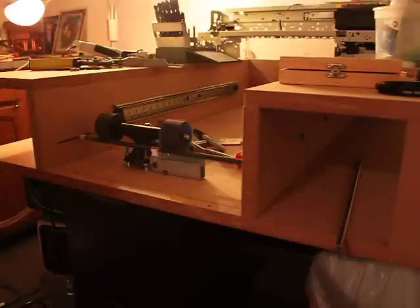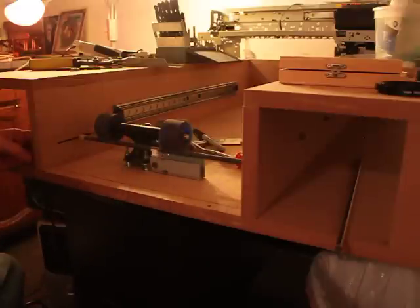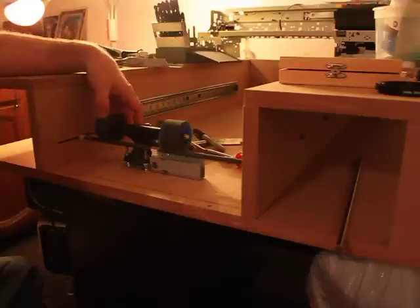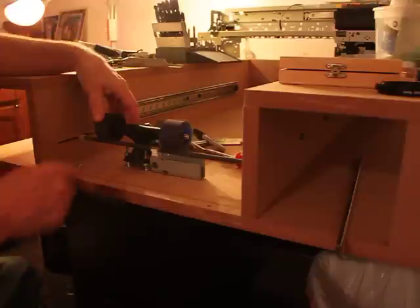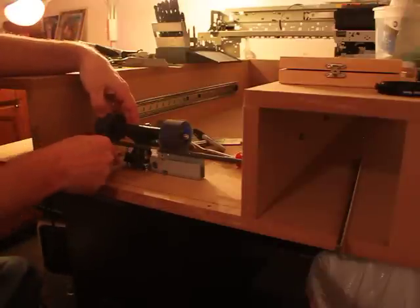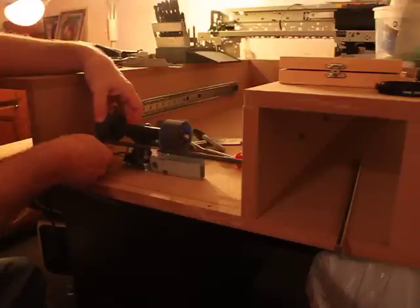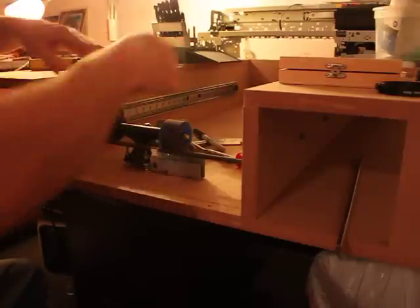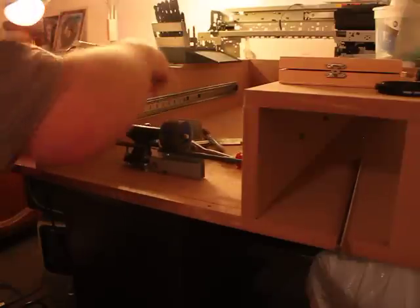I've got my bearings in here — you can't see it over here, but there's a bearing in over here. These are my trucks; it's in place. I have one of my screws too high and I actually scratched my platen. This rod is not spinning on this side, but this side spins really well. So what I've got to do is bring this side down by tightening this bolt until it actually grabs — you don't want to grab too hard because you don't want to put an indentation on this rod at all. We're trying to bring this side of the truck down to the rod.